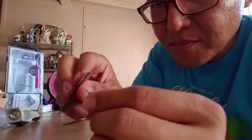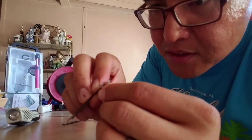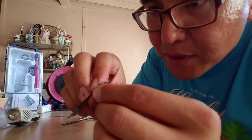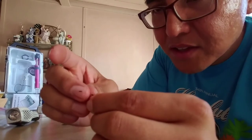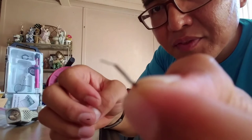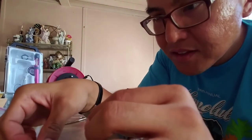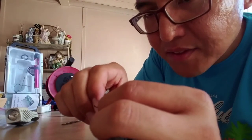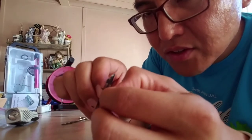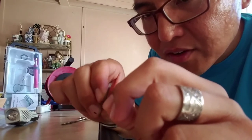What I'm using to strip this really thin piece of wire is just a shaving razor blade to strip the 30-gauge wire. I'm going to try to solder it all back together — this piece actually snapped off the main soldered flange.